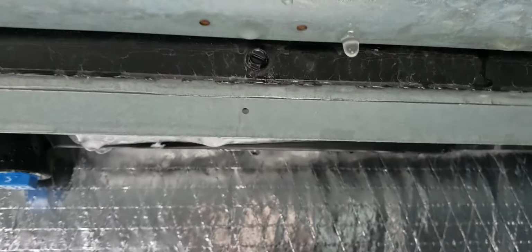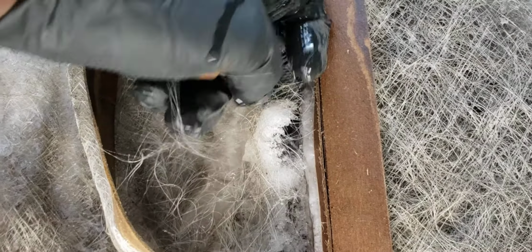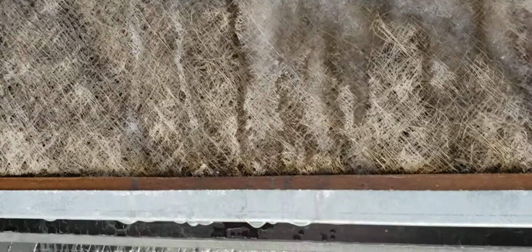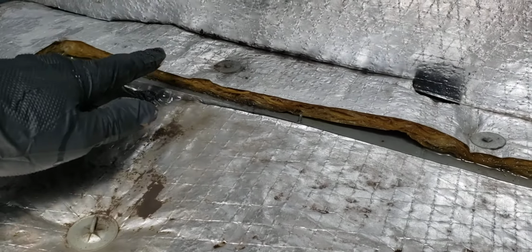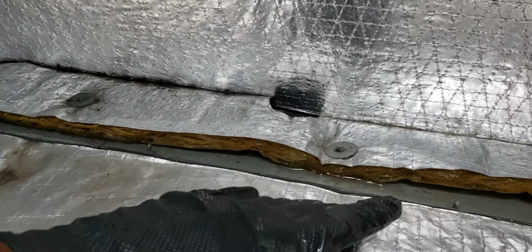Okay, that's water dripping because the coil, like the compressor, the coil behind the filter is also a block of ice. This is ice. It is ice, okay? Up top is okay because the second stage of the compressor was off, but look at all this water dripping. Now this could be above your ceiling, above your bedroom, above your living room, and what a mess. Not to mention, you lose a compressor.